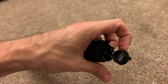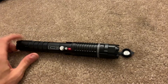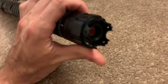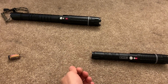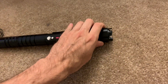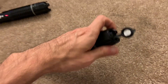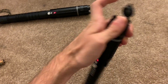Number one, it has a rubber beam stop that will protect you in case your laser is turned on when you don't want it to be, whereas the PLE Pro actually has a threaded one that screws in and out of the front of the laser. The problem with that is over time, if you're pulling and tugging or putting weird forces on it, it'll start to leave tiny little nearly invisible flakes of metal on the lens, which can scratch it. This rubber stop eliminates that problem and also makes it more obvious when the cap is on, because it's pretty easy to see.